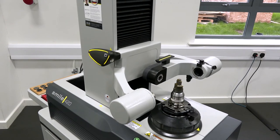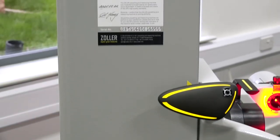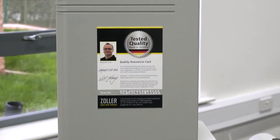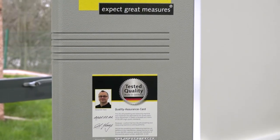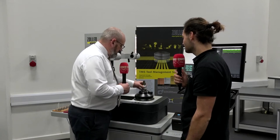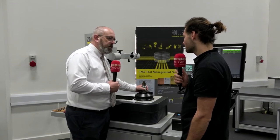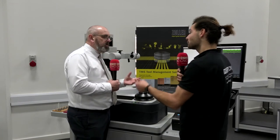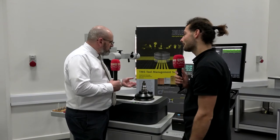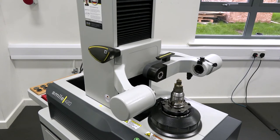Fantastic — a really high-tech spindle, but there's also another part of the functionality of this preset to show off today. This is our full CNC machine running our Pilot 4 software. When an operator loads his tool, we power clamp that tool — you can hear the pneumatics grab hold of it. This is going nowhere. So that's repeatability: we're now gripping this in the same form as you're going to get on your machine.